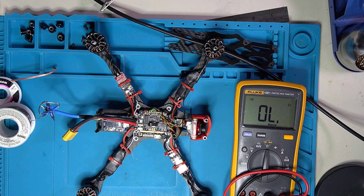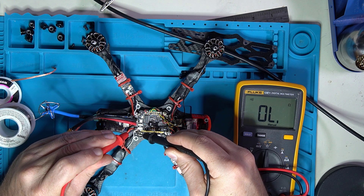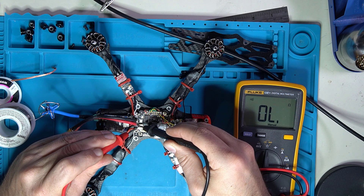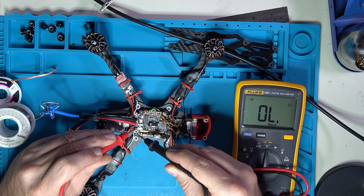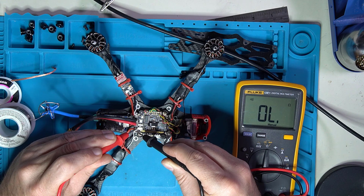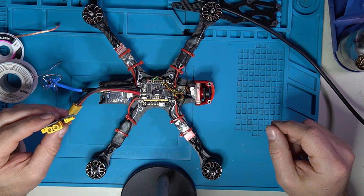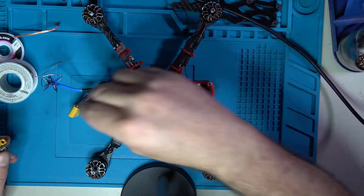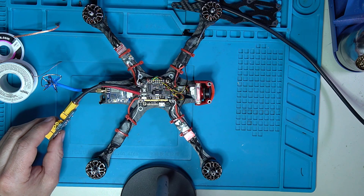Make sure I didn't do anything stupid. I have the multimeter set to continuity mode and I'm going to check my connections. Nothing there. The correct connections are supposed to beep — red to black, no beeps. That's good. The real deal is that I don't trust myself, so not only do I do a continuity test after I solder, but when I plug back in I'm going to use my smokestopper. Overkill? Maybe. But it beats frying a $50 board or whatever it costs.